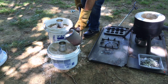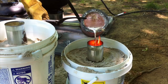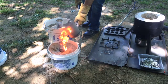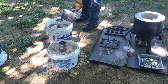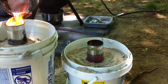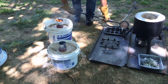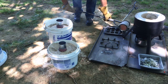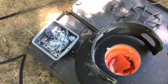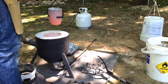If you're not familiar with lost foam casting: when you pour the aluminum in, it will instantaneously vaporize the foam form that's buried in the sand and take the place of it. Pretty cool — it's also pretty stinky. Any leftover aluminum I just pour into this little mini muffin pan. Now I'm going to try casting the paperweight. I used up all my aluminum cans so I had to start using some bits of scrap, but I managed to get another full crucible.